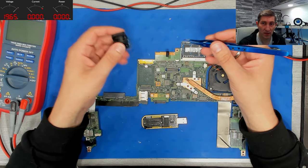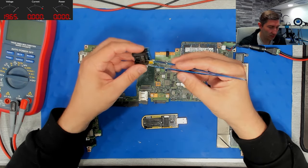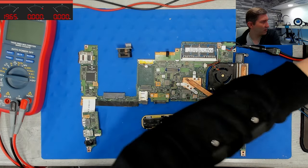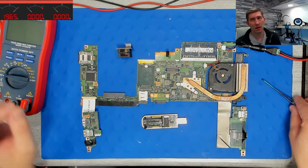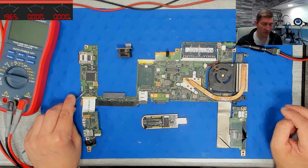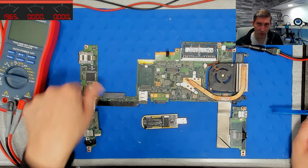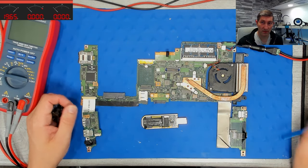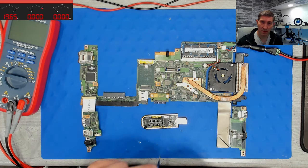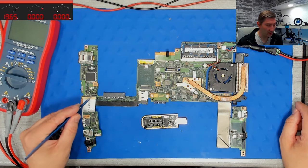And this is, for a beginner, a clear don't. Don't use the clamp. Why am I saying that? This clamp requires that the BIOS chip is still present on the board in a circuit where you don't know where it connects to. And also there is a high chance for connection issues when you put the clamp onto the IC. These two things are well-known issues for reading and writing corrupt dumps. So even if the dump is not already corrupted, there is a high chance you will read out a corrupted dump and delete the healthy dump.